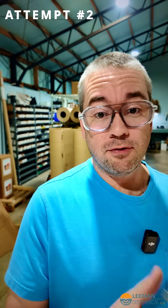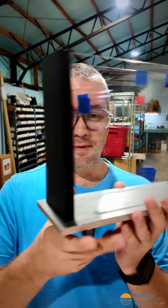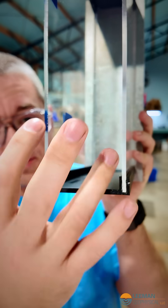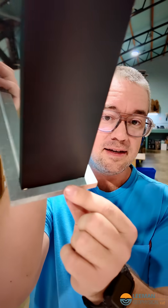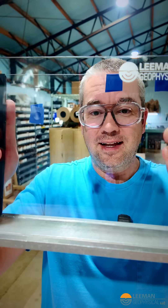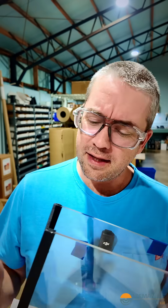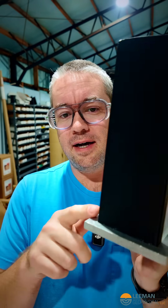So the next thing we tried was replacing the entire end cap with a 3D print. This is PETG, so it's very strong. We weren't really sure, especially with the layer lines being like this, if this was going to leak or not. You can see we've still got the slots for the sidewalls here. And really, this worked pretty well — it didn't leak through the 3D print. We only had one very small leak down on the corner that was easy to fix. It's actually a lot more rigid and I think a little more durable of a product. It's not really any cheaper to make, which is fine, because the aluminum is relatively cheap and PETG is also relatively cheap, but there's a lot of it here and this takes a long time to print. The only thing I can think of now is we'll add some flange along here to help seal down at the bottom a little better and help make the job of siliconing look good and easier.